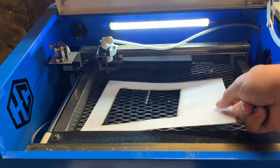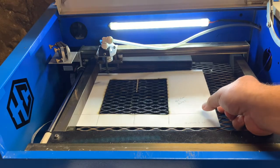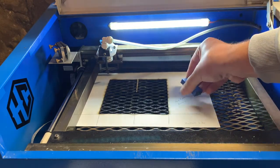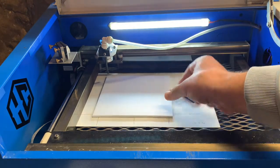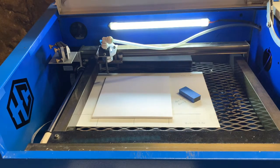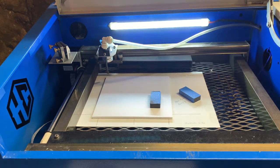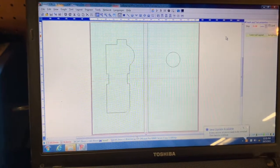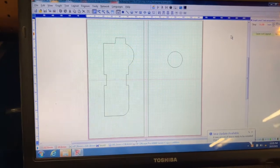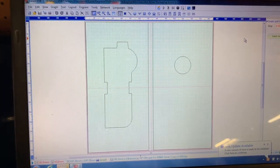As a little added bonus I'm going to show you a packaging trick I do with the K40. I have a template file which is just a piece of cardstock paper — it helps me align the piece of foam board that I'm gonna put in here for the packaging. I lay that over what I'm gonna be cutting out, and magnets are your friend — they keep everything down especially when you're using the air assist. I have a CAD drawing which is going to be my cutout for the packaging for that comb we just engraved.